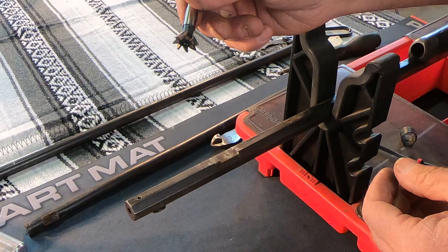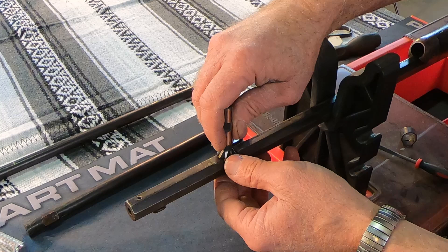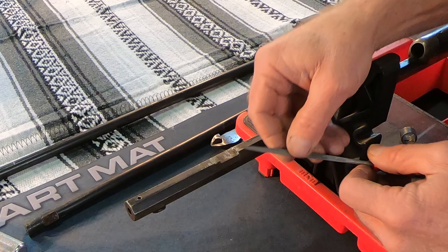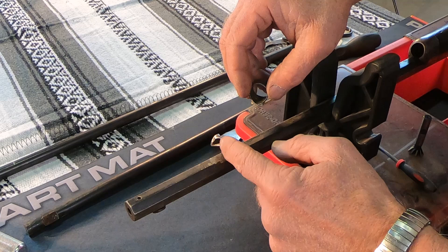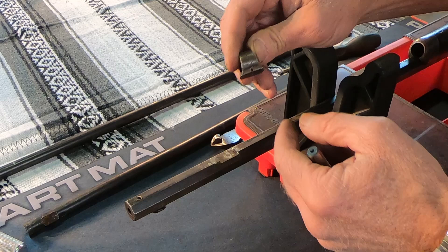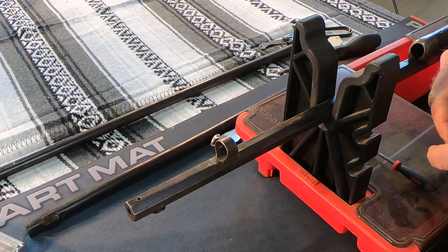What I did here is I got to thinking, and we had just the right angles with this dovetail cutter, so I just put it in there and used it to scrape out that soft solder. It came out real nice and easy. Then just a little finishing touch with a needle file with a rounded tip to dig some of the stuff out of this other side. Now we've got a really nice tight fit. I'm really relieved, because if this dovetail was wallered out in here, we'd have had to use the dovetail cutter to clean it up good, then build up the edges of this hanger and machine those down so they would have fit properly — and that's a big, very delicate job. But there we go, just like that — that's the way it should go.